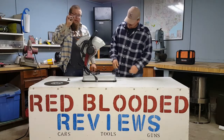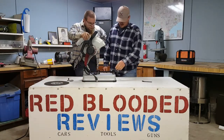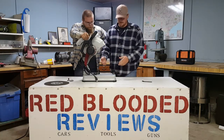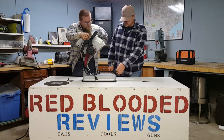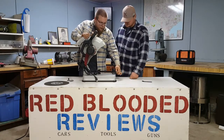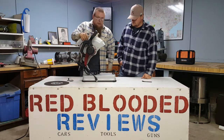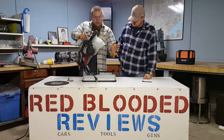I am very surprised about the brushes — that is really cool. On your Makita, they have a little nut thing that you flip over, and I don't really like that. Sometimes it gets caught up and you can't move it back and forth, then you can't turn it. I like this right here better than the Makita one. We'll see how long it lasts. What I like about this most is you can let that down — you don't have to pull it up. You know it's always going to be tight, but you can always just flip that back, move it up, put your piece of metal in there and shove it forward. It does do 45 degrees both ways, but usually you're only going to use 45 going one way.